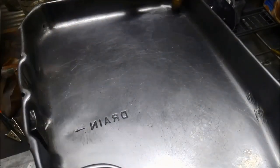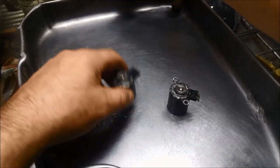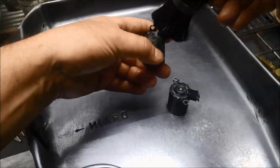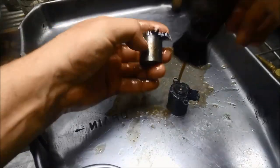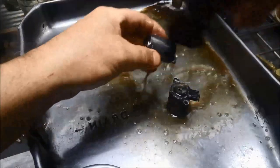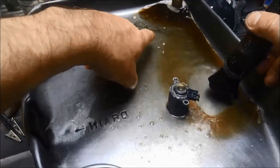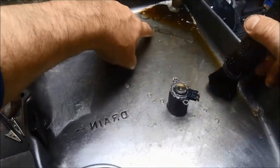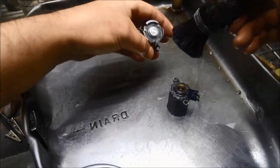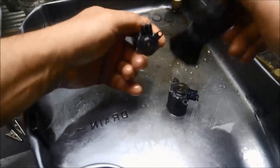Starting off with these two — you can see our wash tray is nice and clean. Before I demagnetize them I'll just give them a bit of a clean so they're not too oily. You can see we've got neodymium magnets under our wash tray — they've already collected just the stuff that's on the outside. So imagine what's on the inside.